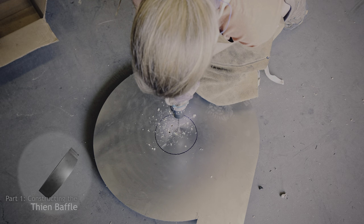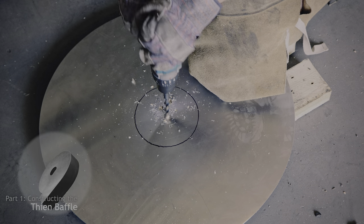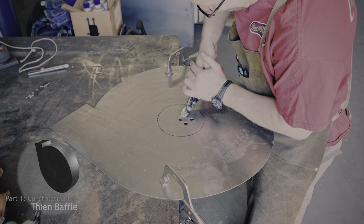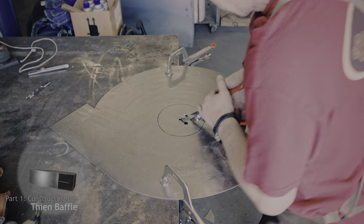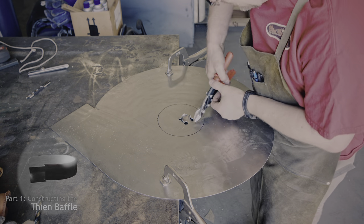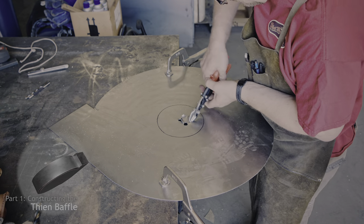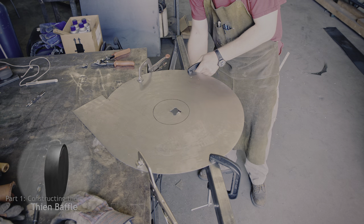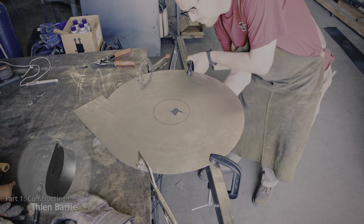Let's talk about the 6 inch hole in the middle of the sheet metal. Initially, we thought we would use a circular hole cutter attached to a drill. Unfortunately, my drill press does not have enough clearance and stabilizing the drill by hand seemed impossible. Instead, we are cutting four 1.5 inch holes and will use a sheet metal snip to create enough space for a nibbler. How convoluted. Another option could have been using a plasma cutter, but I no longer have access to one and have not seen the need to buy one yet. However, I am pretty sure a plasma cutter will be a likely future acquisition.